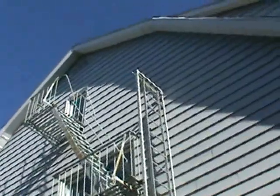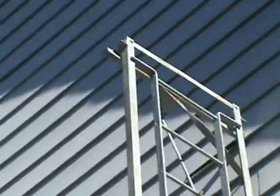This fire escape is just showing normal rusting, and this is what the owners are expected to do — come in and just keep hitting these areas. What we're looking for when we come down here is any rust in any of the major connections. Especially on the treads — is there any connection rust, any tears coming down from above on the rusted connections? That's where you're really concerned: whether the rust is penetrating connections.